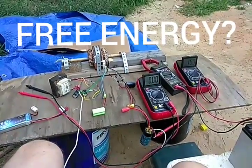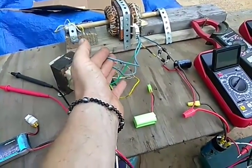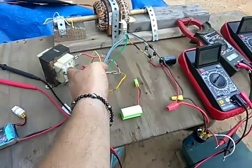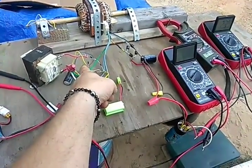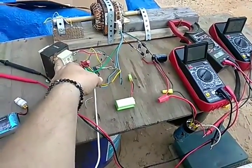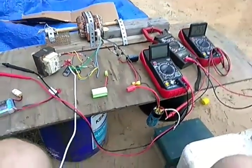I'm not using any mechanical anything. Now I am going to run this coil — this one had 15 ohms and the other had 9 ohms, so there's not going to be as much power coming out of this one. But I am going to run it over here to this transformer, step up the voltage, run it into this rectifier circuit, smooth out the signal, run it to a battery and then the motor. Because it's going through this transformer it shouldn't fight itself — the circuit will be isolated.